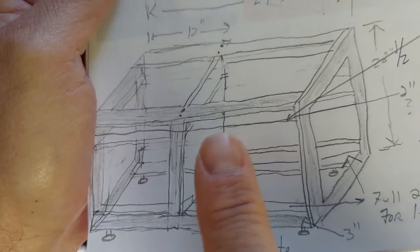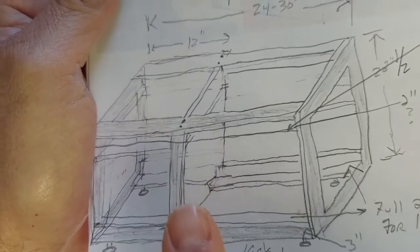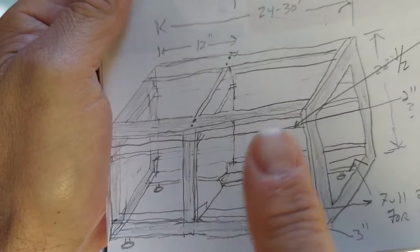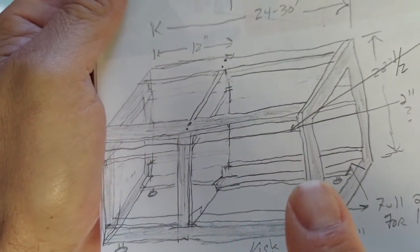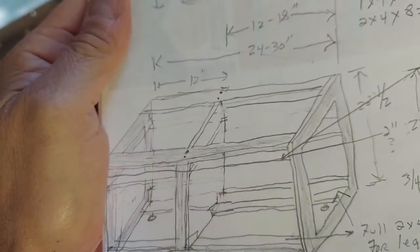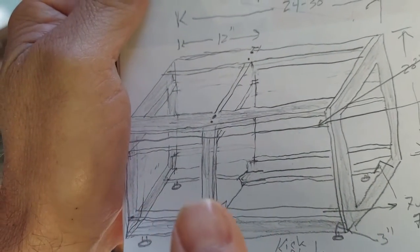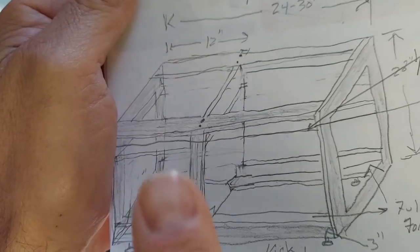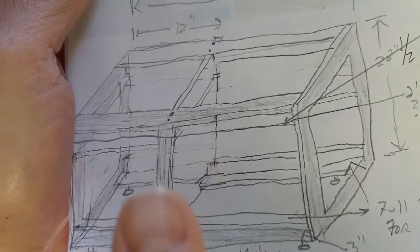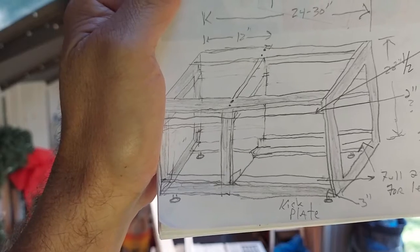And then this piece here and the piece that will go in the front here will be nice wood, including down here. So this will be my framing. I am going to make them all flush so that I can maximize the width of my drawer. And then these will be all the ripped 2x4s for added support back here. And then I'll use 1/2 inch plywood here, and I'll use 1/2 inch plywood here. This is going to be the computer area where the mid-tower computer would go, with a full flipper door. We're going to get to that shortly. So that's the CAD drawing. Let's put it to work.